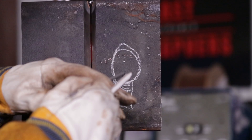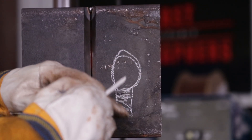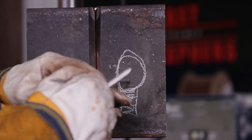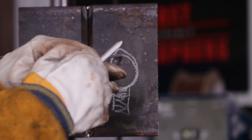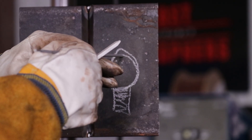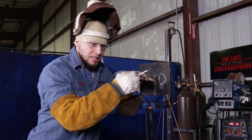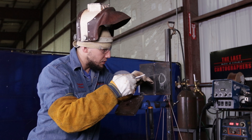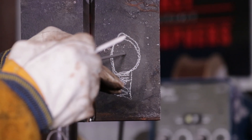So pretty much, I whip it. But there's more to it than just whipping it up and down. When I whip it and go up, I actually push into the top edge of that keyhole — I push, very slightly, gently push. And that's where the pause comes from. I push, pause right here, and as I'm pausing I'm actually pushing just a tad bit, then I come back down to the puddle.